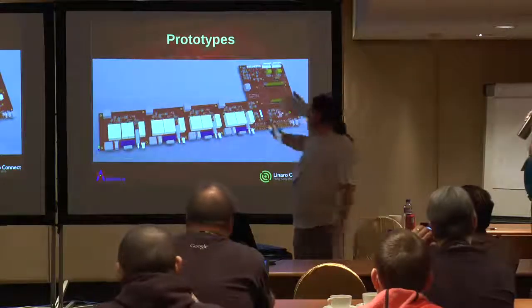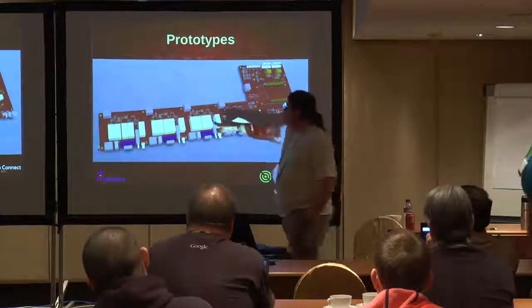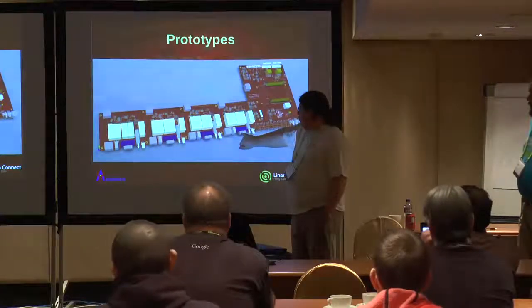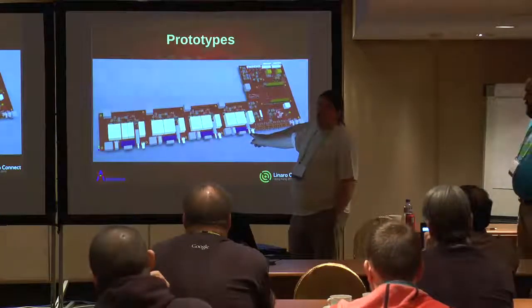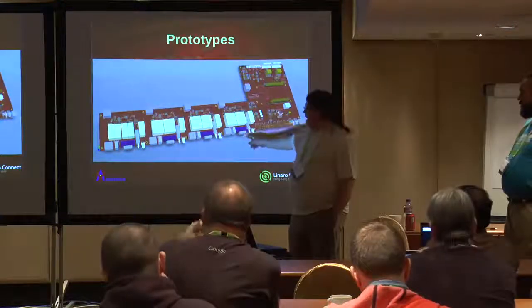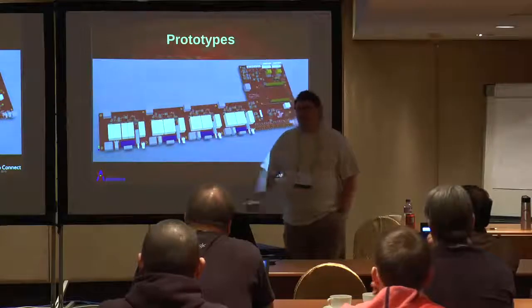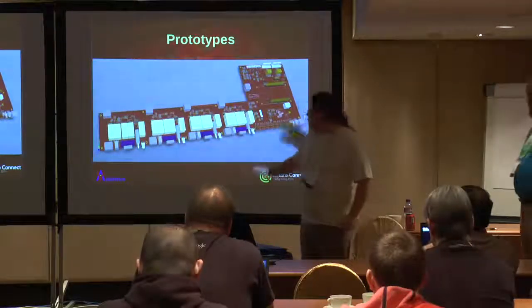So essentially what we've got here, nice and simple, is space for 4 EUTs. Each one has a serial port or a simple UART connection and a switch to decide which one you're going to use. Again, we could have made space and put the switch and just left it on the same connection. Fairly guarantee somebody will switch in the wrong state and will stick -9 volts on the TTL input. No, not worth it.